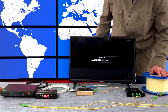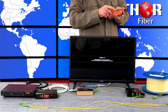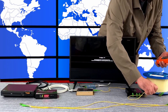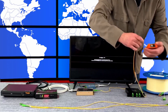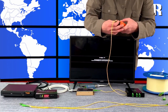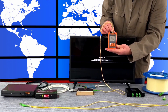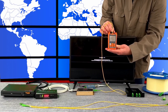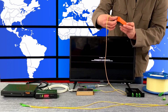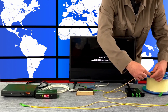Now I wanted to show you on the optical meter: this transmitter is going to give me — not a loss — I'm at plus 4, around plus 4 to 4.5 dBm, just around there. We have a nice clean signal coming out of the transmitter. So now I'm going to add this spool.